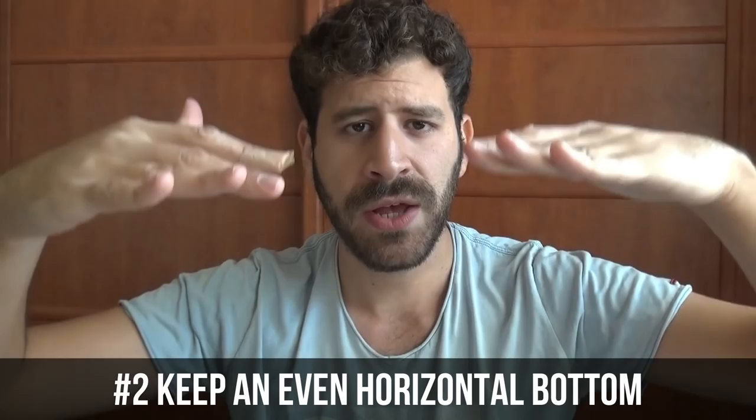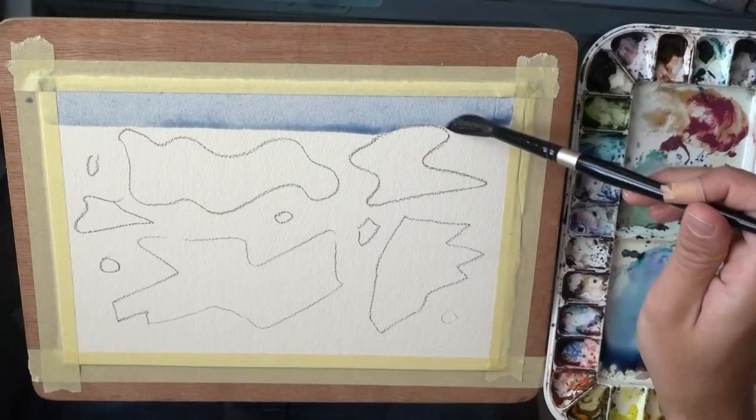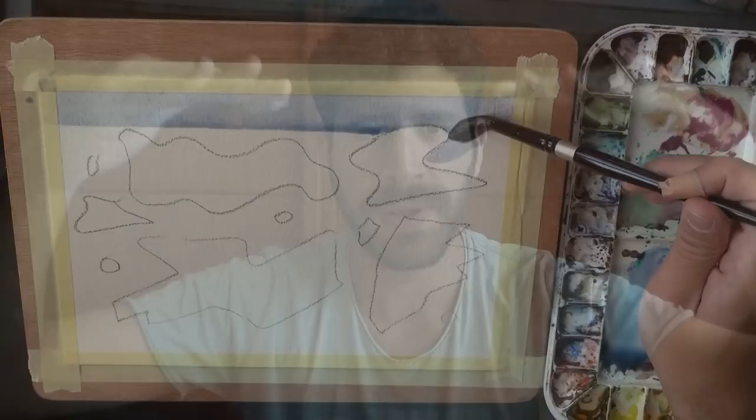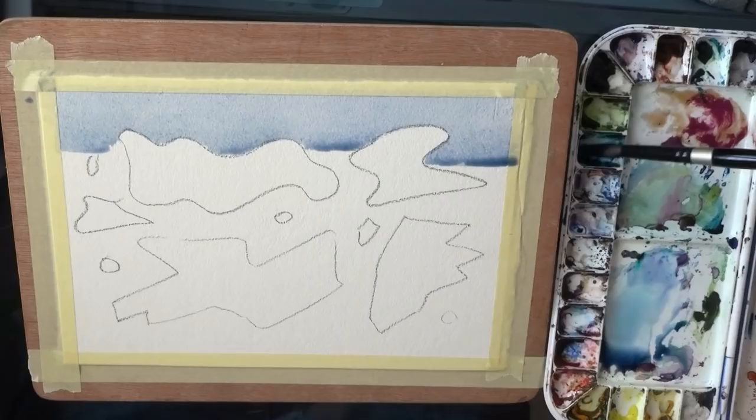The second practical tip is moving evenly from top to bottom. Imagine you have a shape to paint around — you sometimes have to split your work around different shapes. You don't want to go too far down on the right while the left stays at the top. Keep it always even and level, maintaining a horizontal line as you go. You can move a bit down on one side, then the other, but generally you want to make sure you're moving at a similar rate all across the horizontal area.